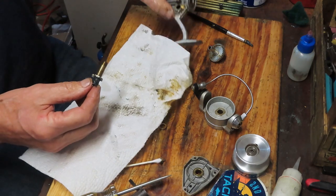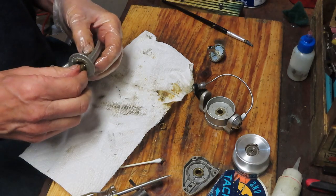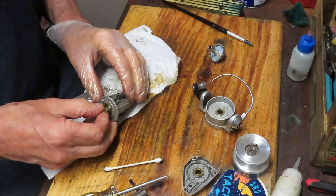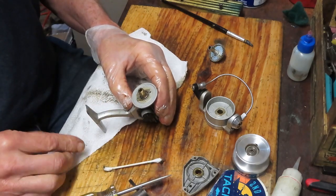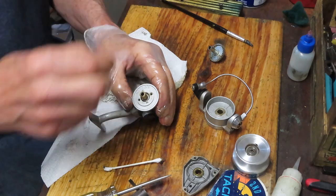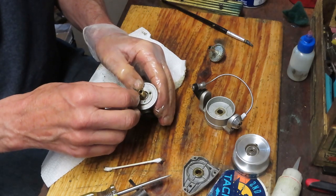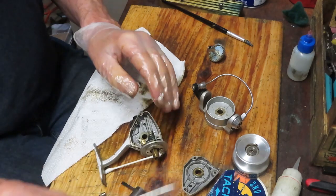This is the setup for the pinion gear, so that can go back in now. The only way that's going in is to first remove that bearing and collar up top — you won't be able to do that without the collar going on next. The lubricated bearing goes on — make sure it seats all the way down. Go into your tray and get your collar for the tie-down. There are two studs and two holes, so remember which ones go where — a picture would help here.